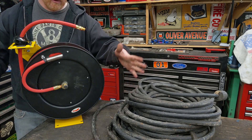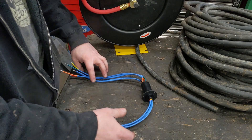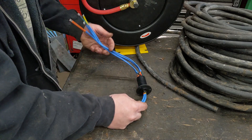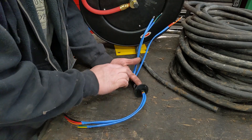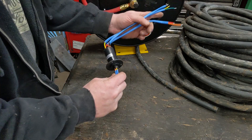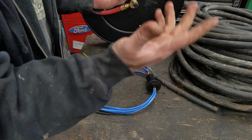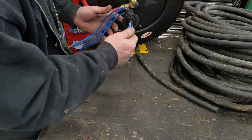This right here is what's called a slip ring. It's commonly used in appliances that spin — windmills are a very common application. This one actually has six brushes lined up inside that spin and touch each other. Six wires come out on the outside, and inside there's a shaft with different copper rings. This allows it to spin indefinitely, rated for a million cycles before failure. It just needs to mount directly in the center where the air hose was.